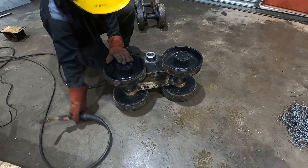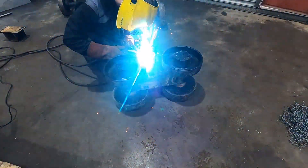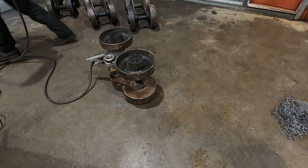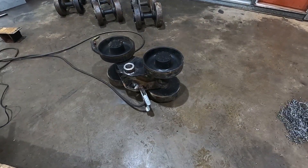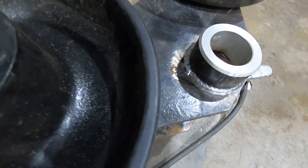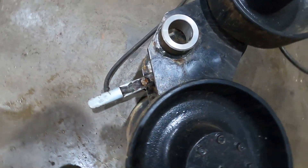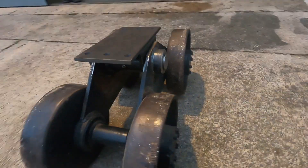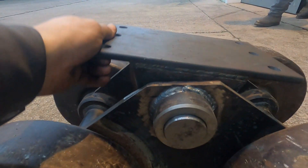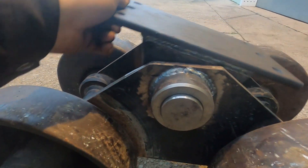Got the MIG welder now, just going to blast around the outside of these. Welded around the first one — a decent weld, won't win any competitions but it's nice and strong and it won't go off. Ready for assembly now — we've put the new piece into the original piece that we've made, and now it's ready for bolting on the machine. See how nicely it turns — it's all packed full of grease, there's a grease nipple on the inside, and the glacier bushes are turning really nicely on that piece of 50mm shaft.